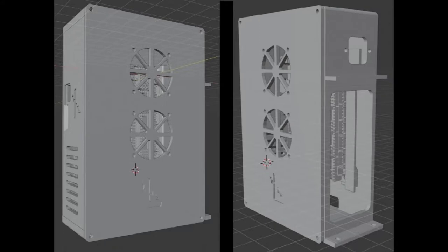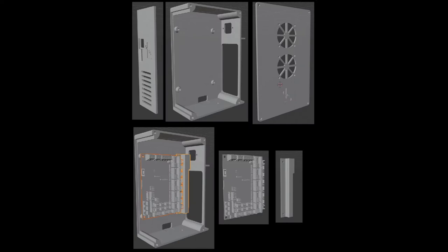The next component is the main board box. There are four parts to print: the main frame that everything bolts into; the cover, which provides locations for two fans; the front cover piece, which I designed as a separate item to make it easier to print and allow for easier access — it's designed just to fit into the location and be lightly glued or taped in place; and then there's a cable guide we'll cover more later. Also included is an STL for the SKR 1.4 board, mainly for modeling purposes.